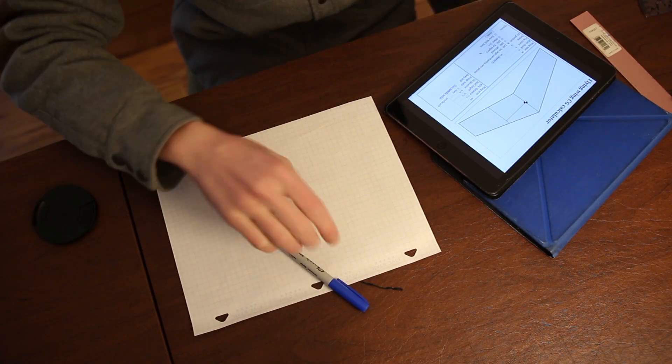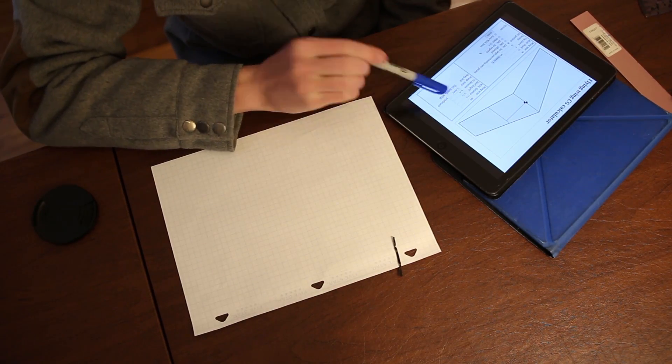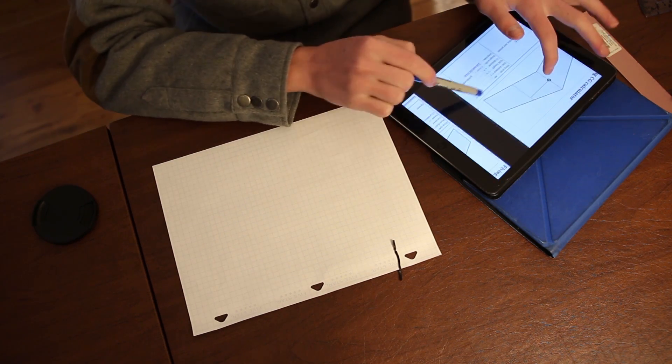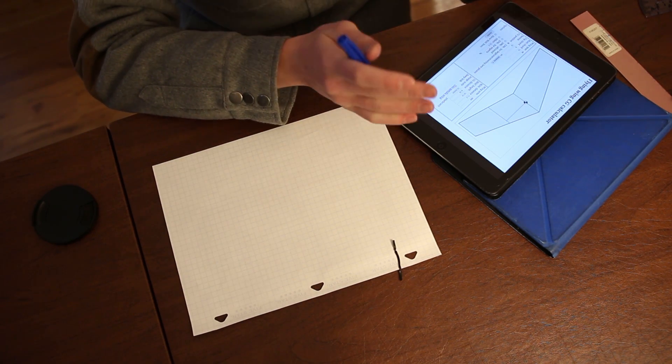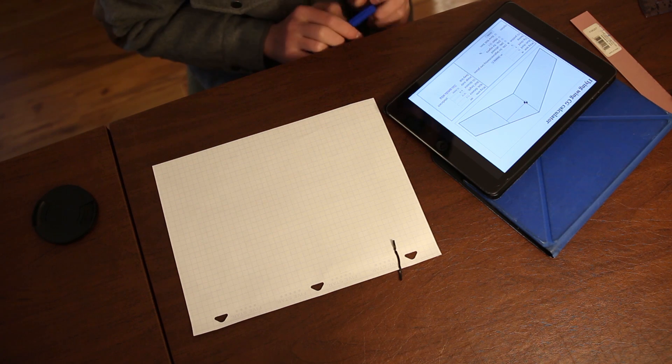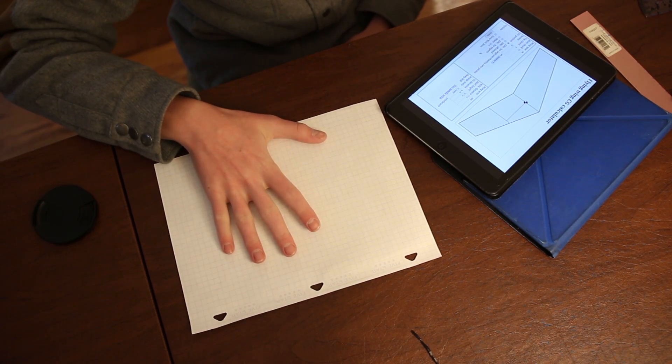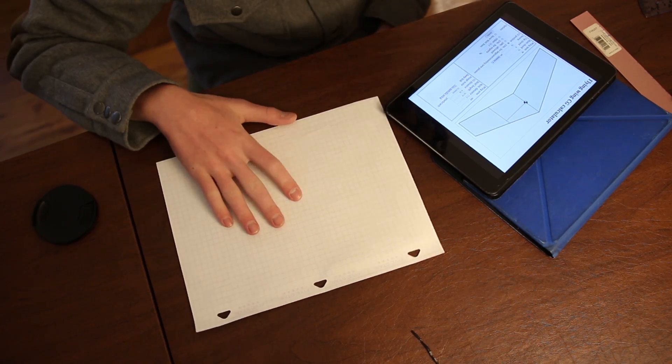I might even try to build an X-wing sometime because I saw Rogue One and it was pretty great. So I'm going to try building an X-wing at some point. But for now I'm just going to try building a wing out of it. To calculate my center of gravity I use the Flying Wing CG Calculator - I'll have a link below. You put in the different dimensions of your wing and it tells you where your center of gravity should be. I'm going to draw it out to get a better idea.